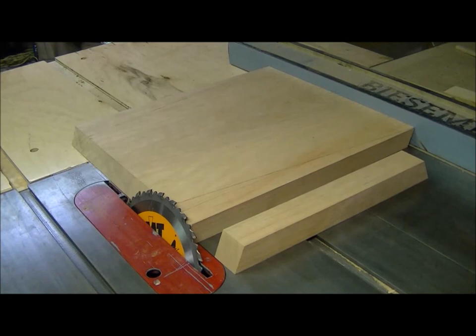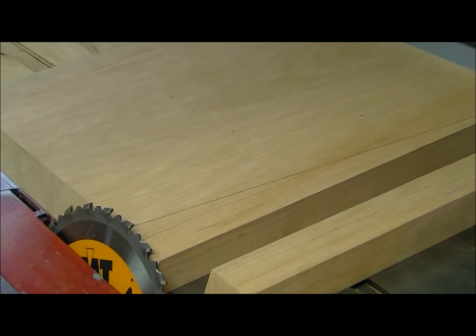The legs are starting to shape now. We've cross-cut each end to a 27.5 degree angle, and that gives the pitch to the sides of the base. We've done the same thing on the batten, and you can see the line marked on the edge. We're going to cut that on the bandsaw to give each leg the taper that it needs.